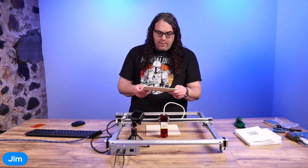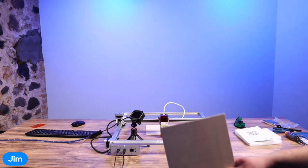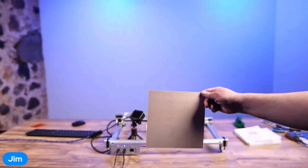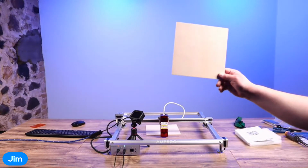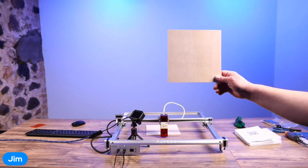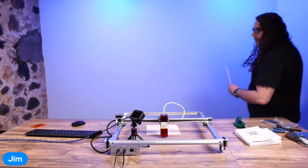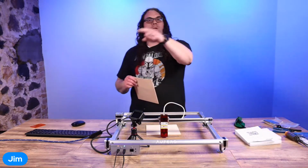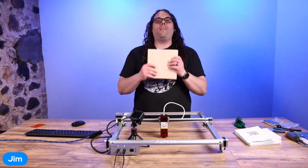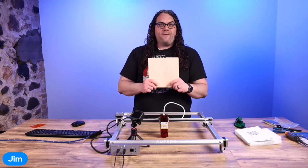If we slowed it down a little, I'm really at 10,000 millimeters a minute. Jim, have a good one. Let's see. Oh, you can't see that. That probably helps if I actually get it anywhere near the camera. It's too light to see unless I zoom in. But anyways, not bad. Jim, thank you so much for coming, though. Not bad for 10,000 millimeters a minute, at 95% power.